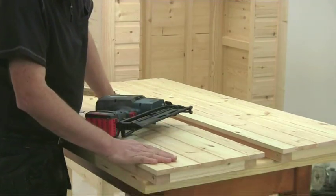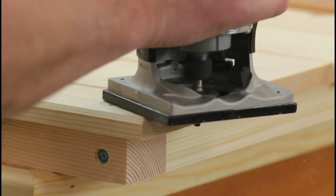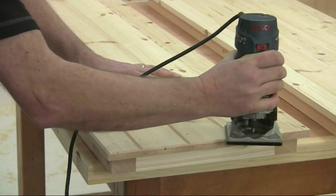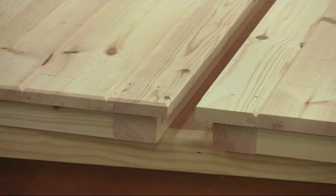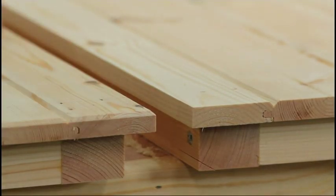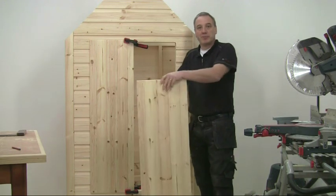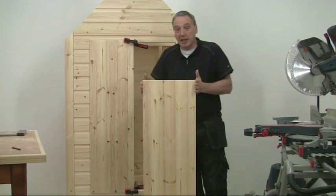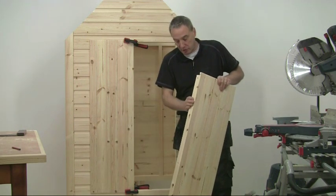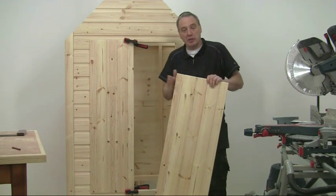With both doors nailed up, I'm running around all the outer cut edges with a router fitted with a 45-degree chamfer bit, just chamfering off all the edges to put a little V on it like the actual V on the tongue and groove itself. That just neatens it up considerably - you can see what a difference the router makes, it looks so much more professional. I'll admit I think I've made the doors a little bit over-wide, but I can trim a strip off the overlap where the two doors meet and run it round with the router again - no one will ever know. I'll sort that out properly when I fit the hinges.